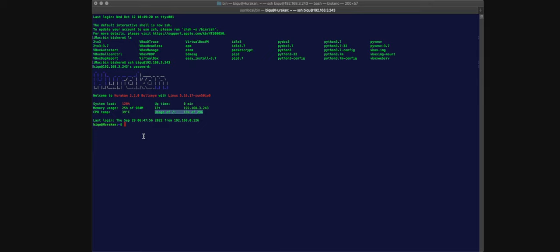Oh, okay, so it has 1 gigabyte and 512. That's good. And it's the lower, well, we don't care. So now at this point, if you go to the manual, I'll put a link in the description, the manual of the Manta card, the adapter, there is an instruction how to install the script that will install all the other software. It's in chapter 5.5, installing Klipper with the Kiauh script.